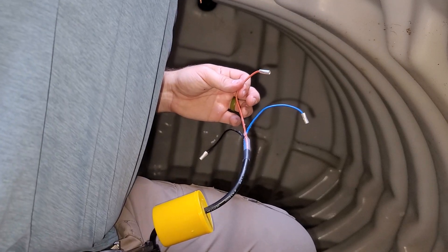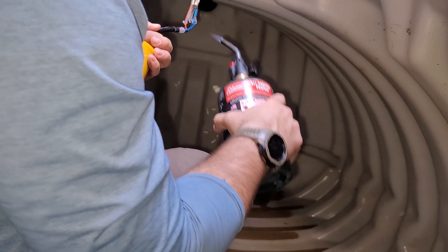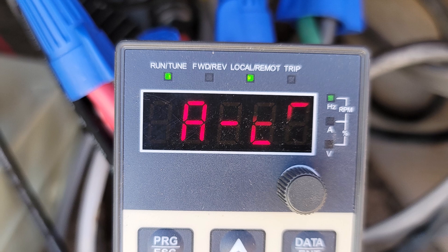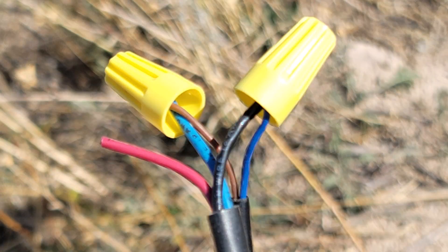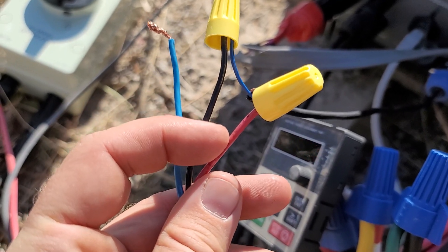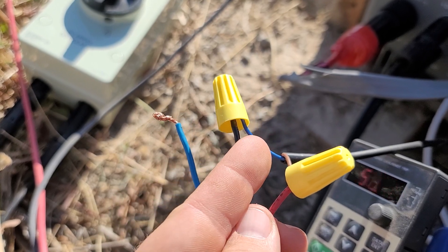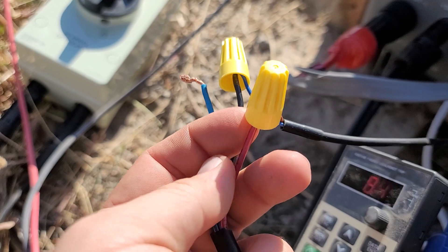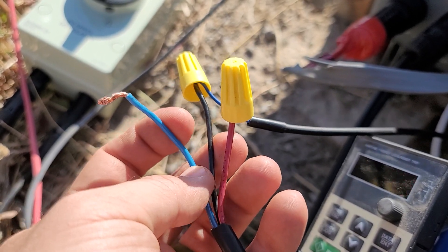I'm going to take the new float, strip the ends, and put butt splice connectors on them so I can attach them to the existing wires — because in the end, these are all just copper wires with different colors surrounding them. But even after swapping the new float, I was still getting this ATF error. I was tired of this not working and could only use it off of my inverter by switching the breaker on and off. The issue was that the wires were done improperly. With my existing older wire, the red is actually a brown on the new system. So if you have a newer system, you want to go black to blue — the skinny blue goes to the controller connection. From the float, I have the black, and the blue is from the connector. My red from the float goes to the brown on the controller because I had the old wire, where the new wire's red is brown.